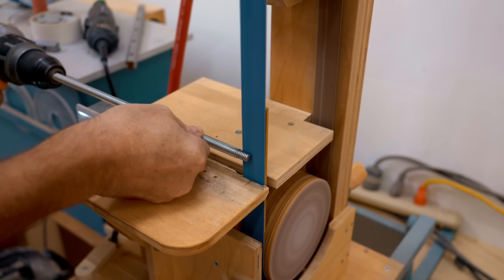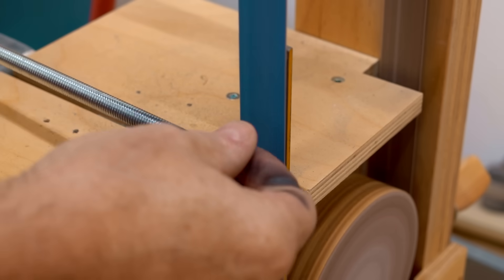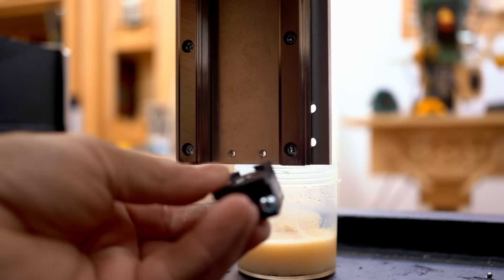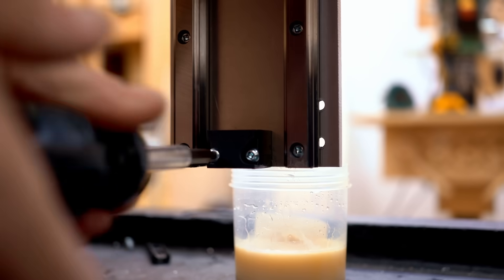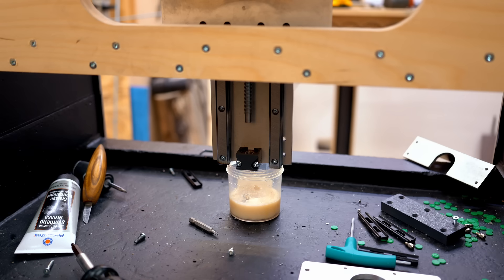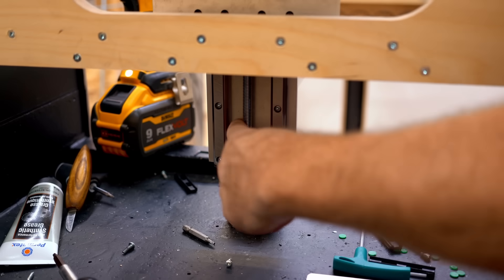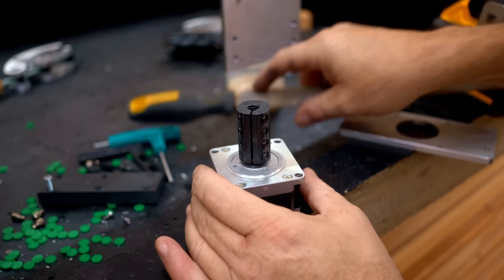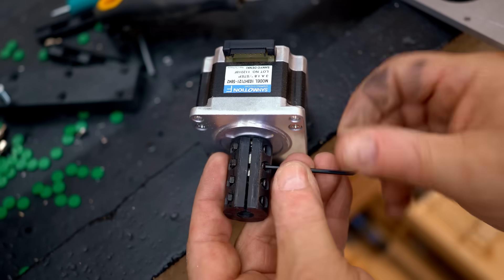Using regular threaded rod for the lead screws and these 3D printed nuts is another real world compromise where I looked at how much I'll be using this machine and weighed that against the cost to build it. Like the old machine, the lead screw for this axis is just regular 3/8 inch threaded rod, and I'm turning down the end so it's the correct diameter to fit in the bearing. That bearing is held in another 3D printed block that mounts on the bottom of the spindle plate with a couple of 8-32 screws. Then I can thread in the rod — I use the drill to speed that up and then thread it in by hand to guide it into the bearing. The coupler for this axis is also 3D printed and threaded so that the lead screw screws right in, and I push that onto the shaft on the motor.